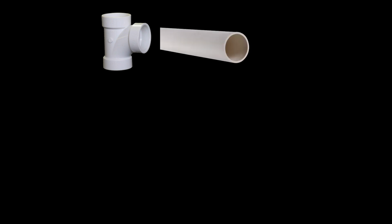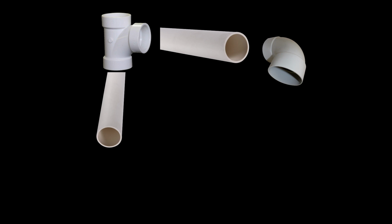So for the layout, you're going to take the plain T. This is going to create the junction between the downpipe, the inlet to the water tank, and the well. PVC pipe is going to be attached as the inlet, and then on the end of that you're going to attach a 90 degree elbow to direct the flow into the tank. Below this we're going to attach the well, PVC pipe in this case, and then on the end of that the threaded access coupling, and then the threaded cap to go on the end there to allow the first flush to be cleaned out after the rains. As you can see, it's a very simple and easy to put together system.